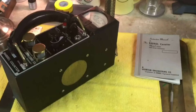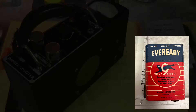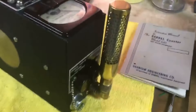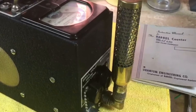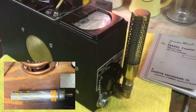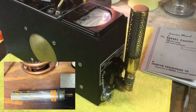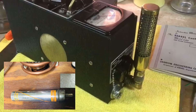To get this going, I manufactured some specialized batteries - these things took three 45-volt B batteries. They use a standard 1B85 Geiger tube, which was very common back in the day, located here in the front end within this solid brass enclosure. They also came with an option to purchase 6306 bismuth tubes, which provide a slightly higher count rate.